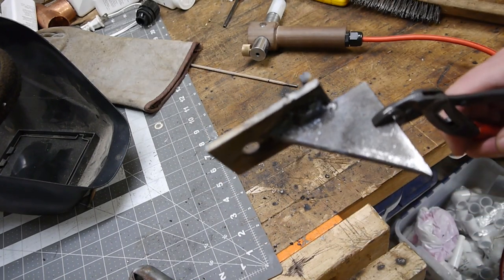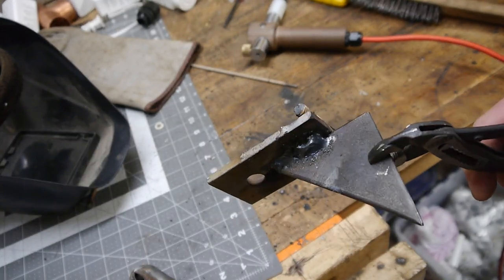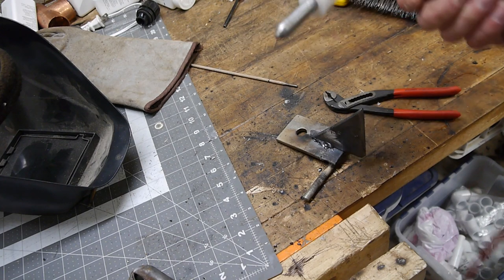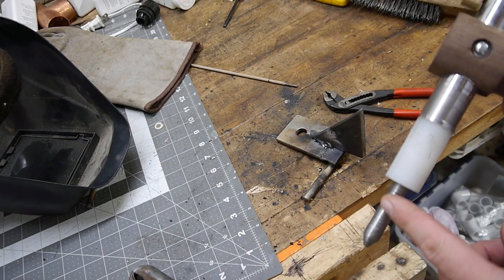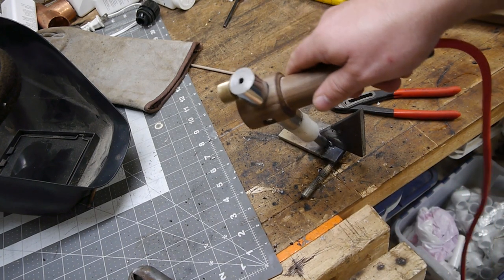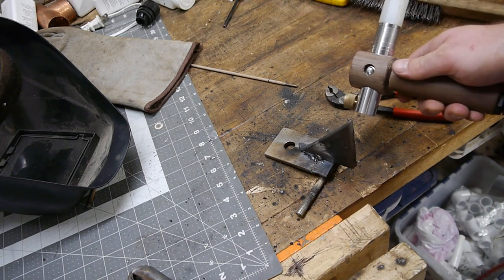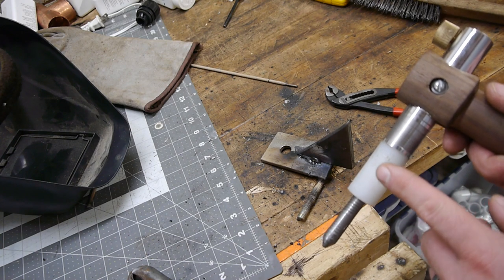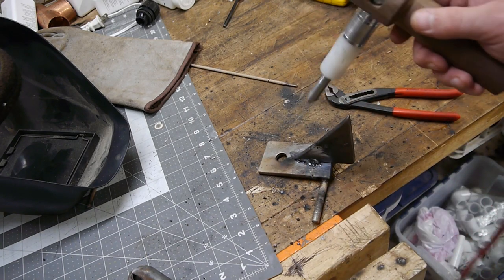Well, for small uses and my hobby uses, I think this thing's going to work just fine, pouring down more and more weld than I can really ever use. As to this hammer, it's just some, I believe, 3/4 all thread turned down to 3/8-16 here, and then just a point put on it. It's working pretty well. Kind of like a combo chip hammer and stick welder. This UHMW acts as an electrical insulator, so I can still have the clamp connected and it won't arc out.